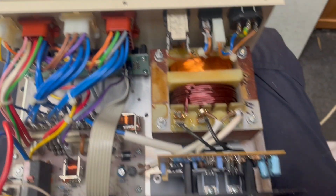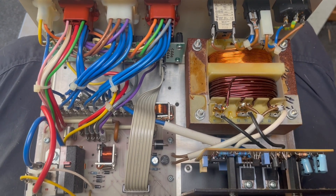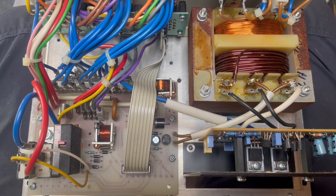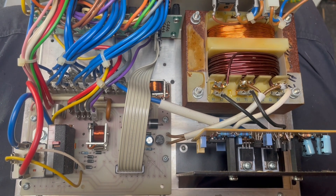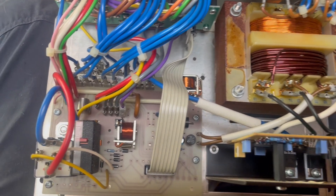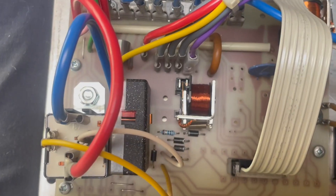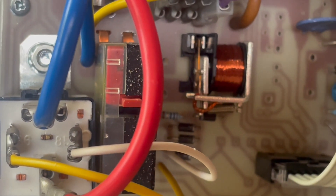As you can see, I've taken the EBL out and removed the cover. There are basically six screws on the top cover and three screws down either side — 12 screws in total to remove the cover. We are then looking at — bear in mind this is the EBL 104-2, which seems very similar to the 104-3 that I've seen diagrams for. I can't find a diagram for the dash-2 model, but fortunately it's very similar to the dash-3. We're looking for relay 5, which happens to be the bigger of the relays in the unit.